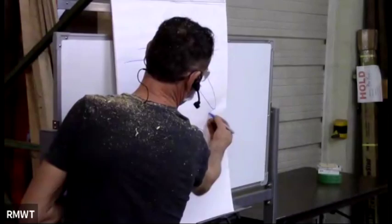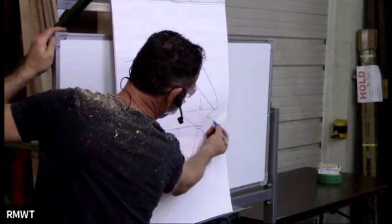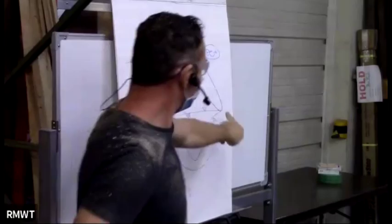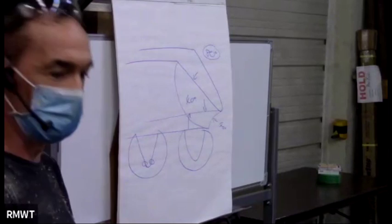So straight wings, and then the 40 degrees is the 40 degree bevel. That's the included angle that's doing the work. That's the cutting edge there, that's 40 degrees. And then from the wings upwards is another 40. So the two together equal 80, which means the nose is slicing 10 degrees before the wing is peeling in there. That makes sense. I'm actually getting my finish on my surface before the wing comes in and throws a chip on the floor. So I've already got a nice clean cut surface.